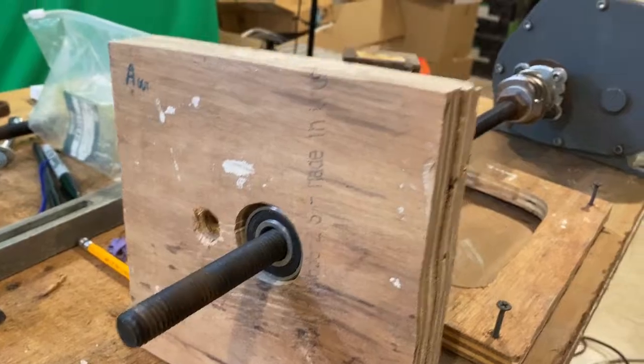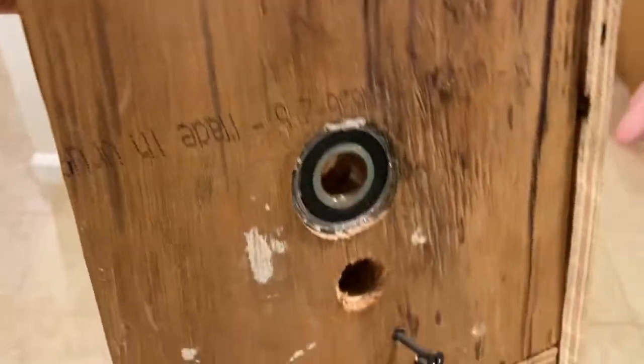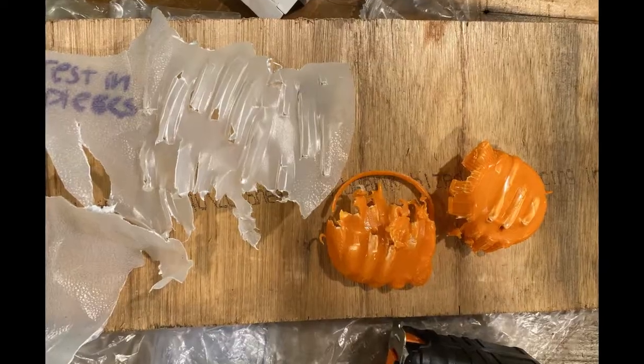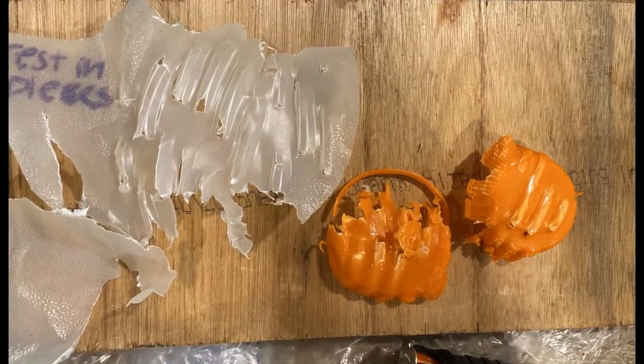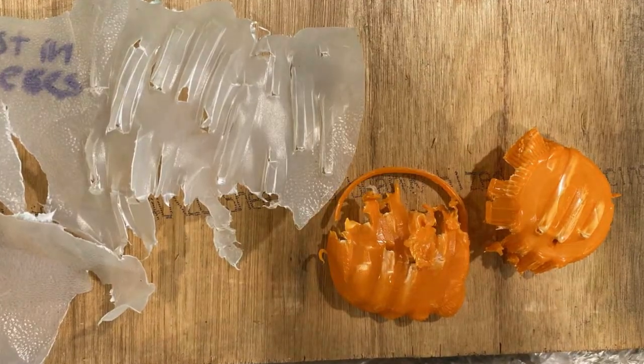Here's what the finished box looks like. Note that the sides that the rods go through are doubled up because those will face some stresses between the two rods. I noticed that the first time I used it the plastic wasn't really getting cut — it was getting smushed between the blades and the washers on the other side, so we'd have to fix that.